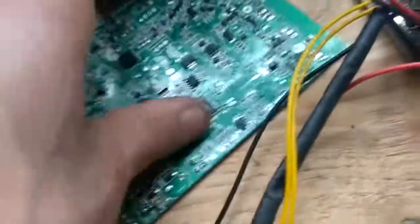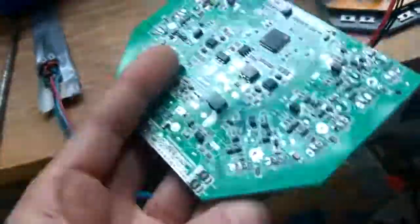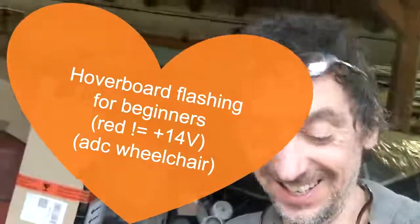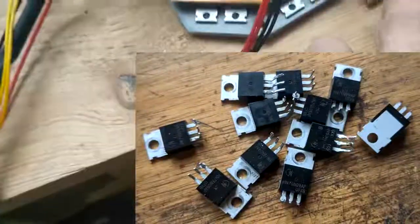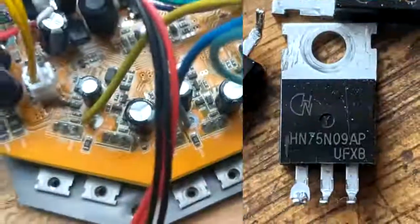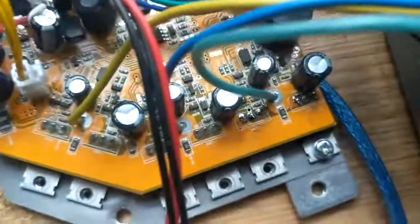I salvaged these completely. This board burned because I had connected plus and minus in reverse - a beginner mistake. I was lucky that only this board burned and not the ESP and everything else connected to it. So now I have lots of MOSFETs here. If I can confirm that the gate is still behaving like the other gates, then it's fine to solder in these replacement MOSFETs.